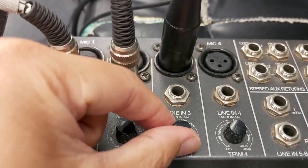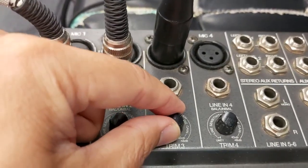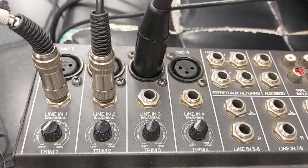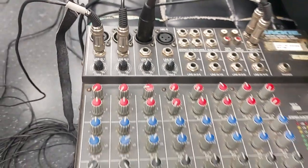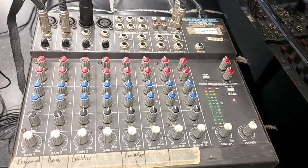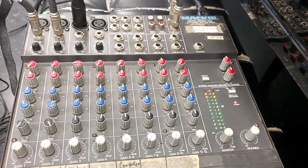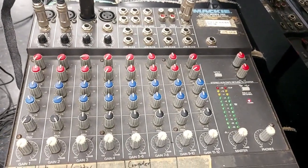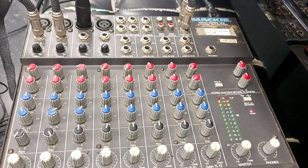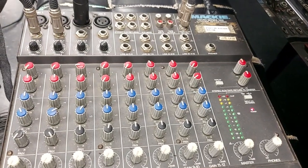Keep it conservative first — keep it low, then slowly bring up to high, because especially for microphones you can get feedback. Feedback is when the sound from the speaker goes into the microphone and it activates over and over again in an infinite loop. If you turn the gain all the way up, your voice comes out of the speaker, then back into the microphone, then out of the speaker again — infinite loop. That's what causes that squealing sound. To reduce that, turn the gain all the way down first and then slowly bring it up rather than cranking it all the way up. If you turn the trim to just the right amount you will get the right amplification without causing feedback.